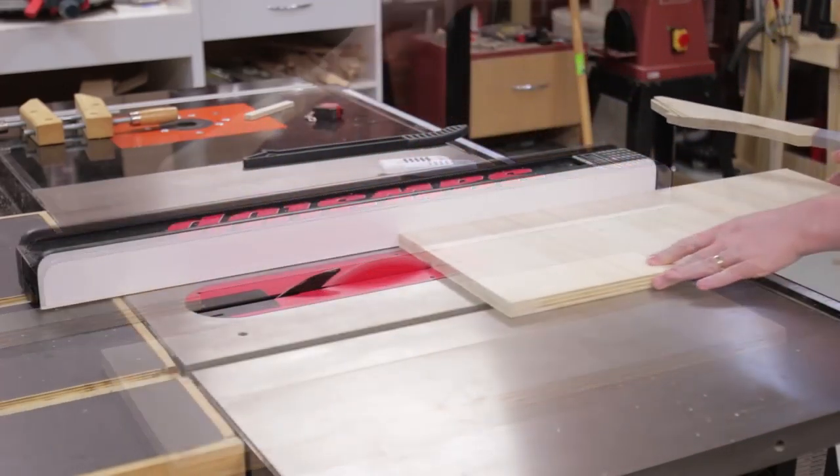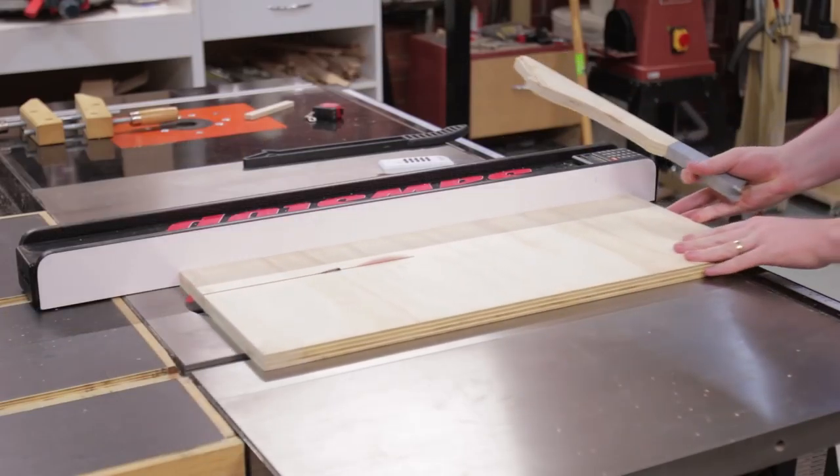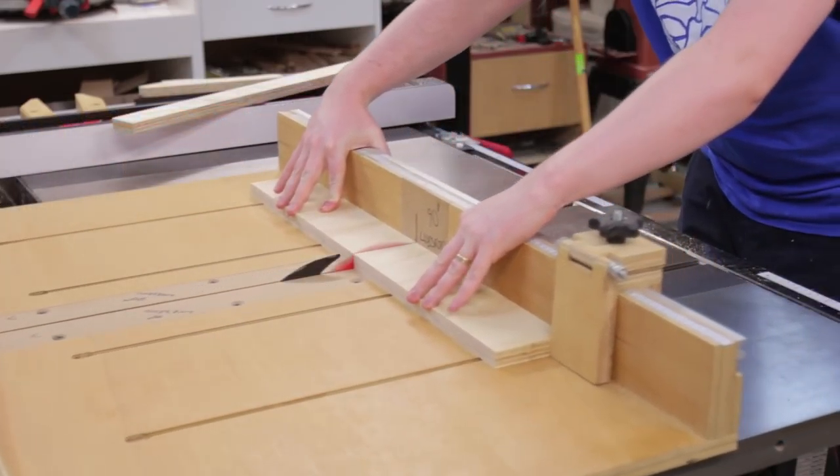The vertical guide that wraps around the post was made in the same manner, just a little bit skinnier. The major difference is that it receives a 35mm hole on one side so that I could tap it with an inch and a half 6 TPI tap.